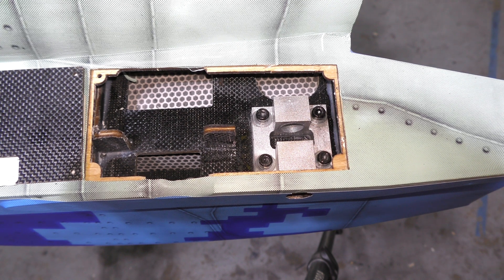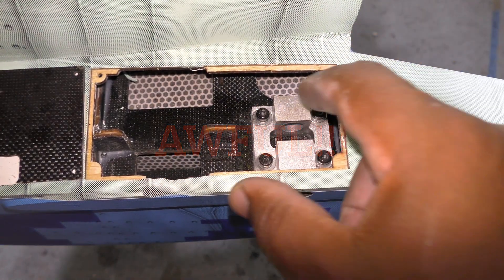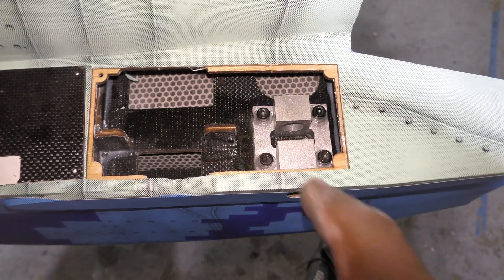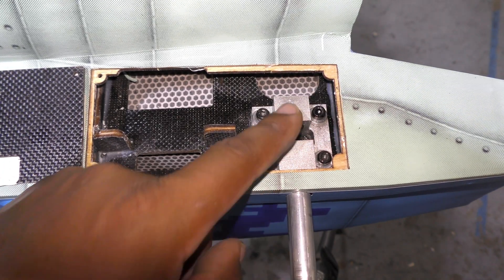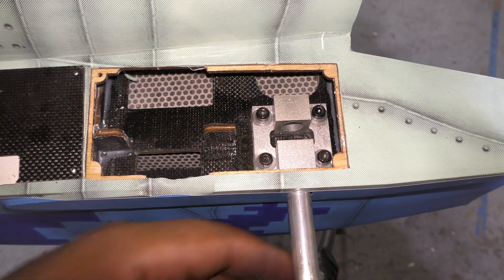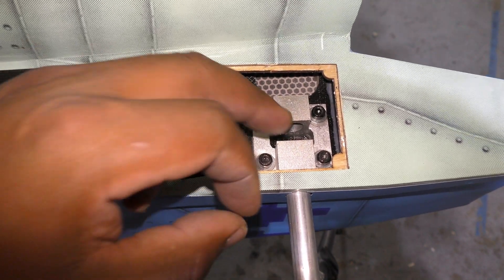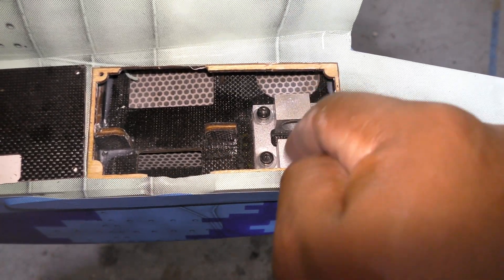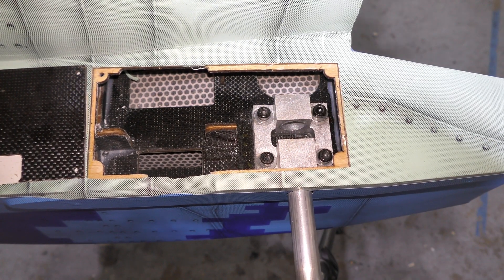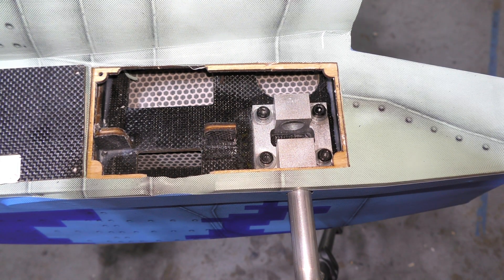I'm a lot disappointed — all that we have in here is this collar with a bushing. There's no ball bearing in there, and this aluminum rod is supposed to slide in from out here. You're supposed to put a collar in between to keep it in place, but it's already sticking. This is terrible design in my opinion, because there's friction that's going to happen in here and that's not going to be good for the elevator, so I'm going to have to figure out something to fix that.